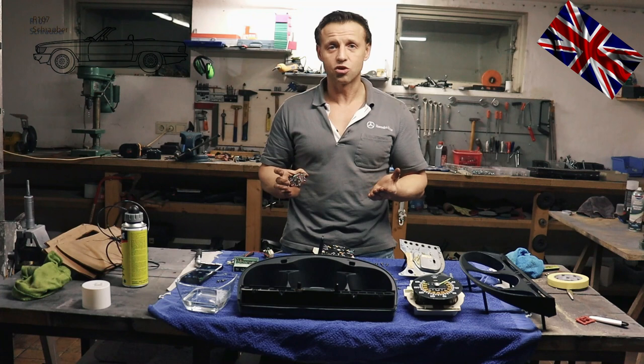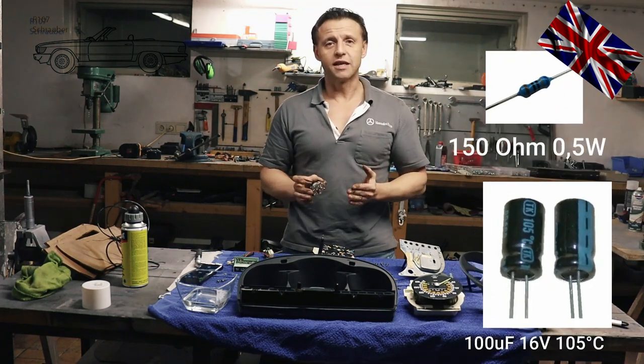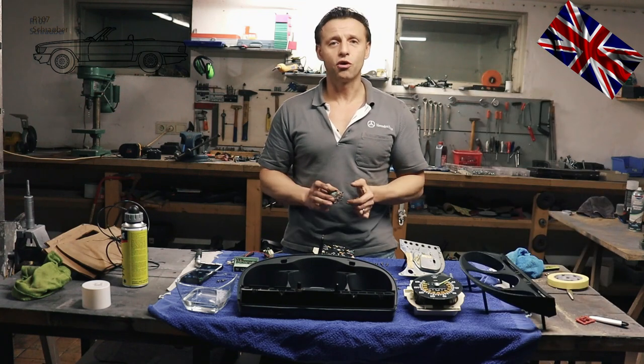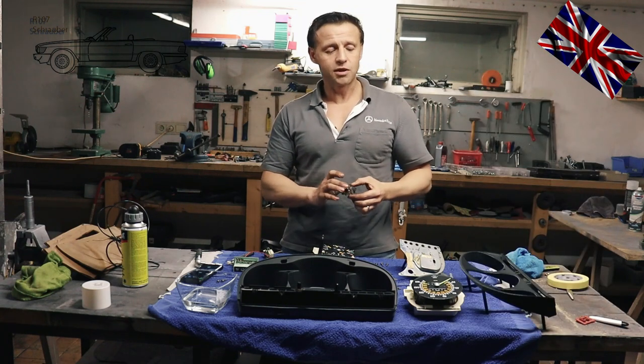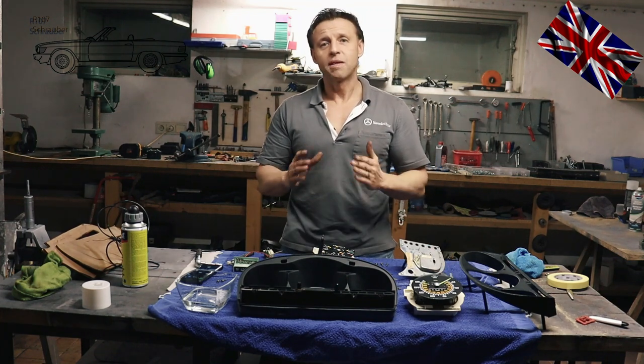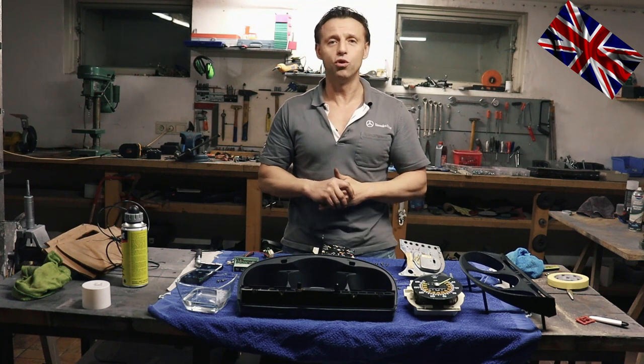In most cases, this is because of two reasons. The soldering point has cracked and current flow is interrupted, or the capacitors are blown, or both. Please see the top drawn picture on the right hand side. How to repair it without damaging other components is today's topic.